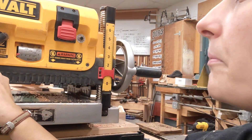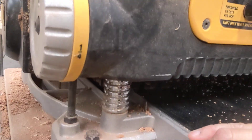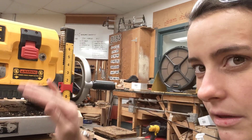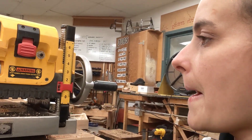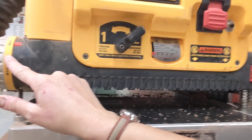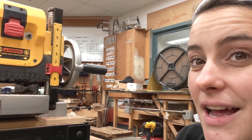I always start with number two, and then toward the end I go back to number one. It's a pretty simple machine, honestly. This dial here shows different parts of an inch, and I have it set to an eighth of an inch. That basically makes sure that because when we're planing, we do a lot of repeated passes through the machine, it's really easy to lose track, and sometimes you can over-plane something — plane it down so it's too skinny. In planing, we're changing the thickness because we're taking some material off, and I take material off of both sides always. I have this set to an eighth of an inch, and these big threaded bolts are connected to this depth setting. When I get to an eighth of an inch, it won't allow me to lower anymore — it won't allow me to make any more cuts after that. So that's kind of like a backup in case I am making any mistakes.